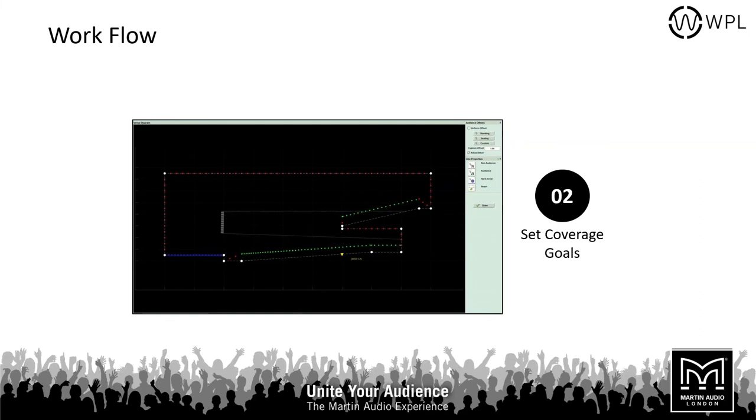So this means, for example, we can get a very quiet stage behind the arrays, which means we don't have all the backwash of the PA going back into the microphones, causing problems with feedback or muddying the sound for the whole venue. All that can be moved and, for example, put on the back wall or a balcony front to stop any intrusive reflections that are happening within the venue, further improving the quality for everybody listening within the space.